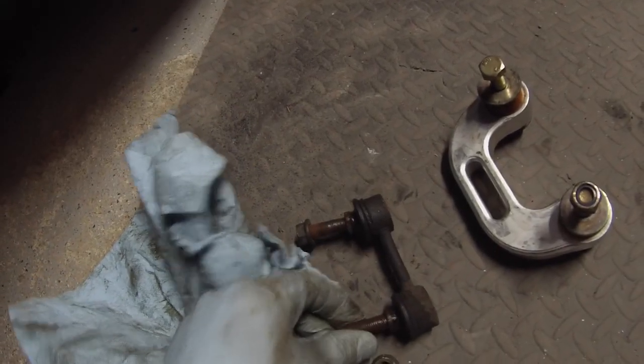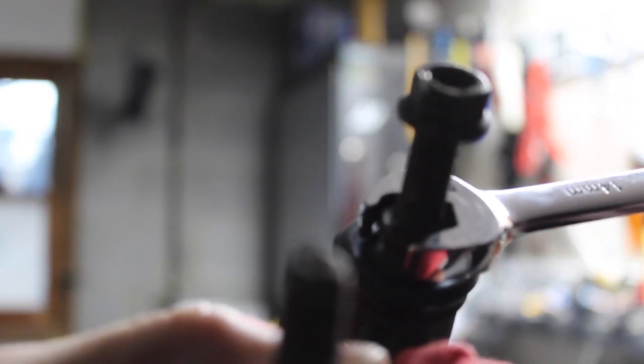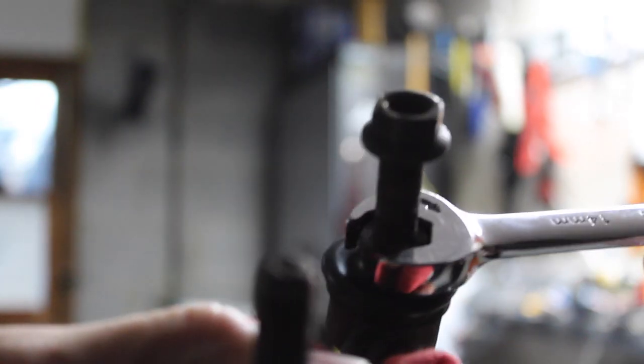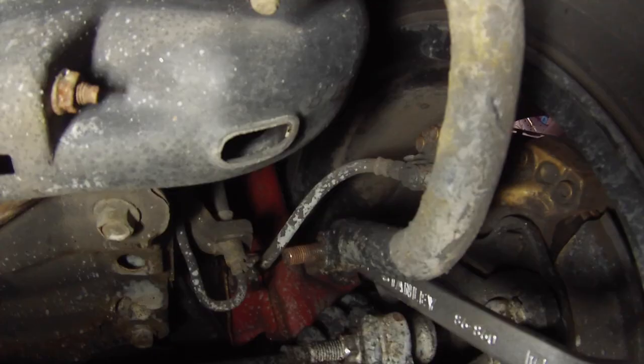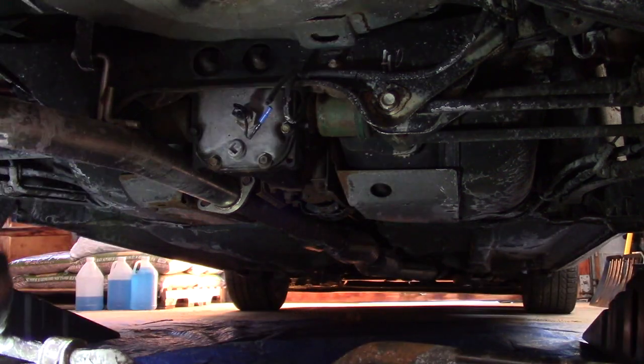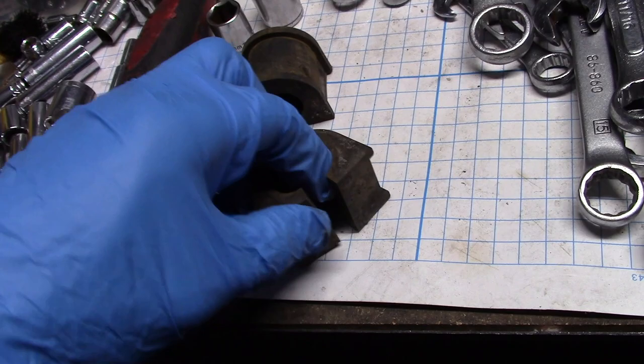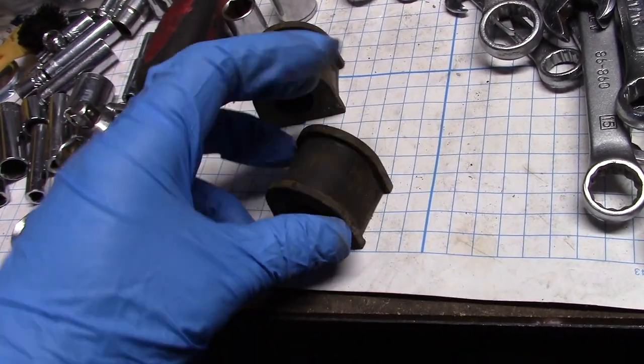You can see there's a 14 millimeter bolt here that will spin freely, and you'll never get it off that way. There are hash marks here where you can fit a 14 millimeter wrench — it goes right here — so the 14 goes in like so, and then you can take that 14 millimeter nut off by holding this.